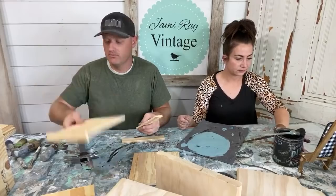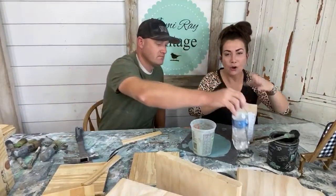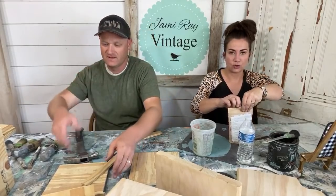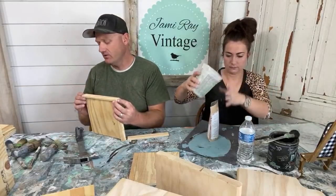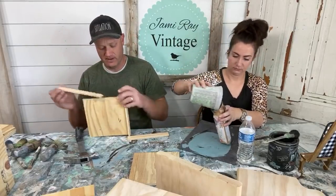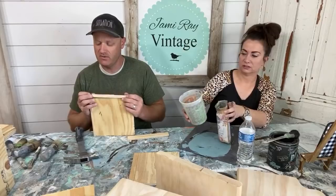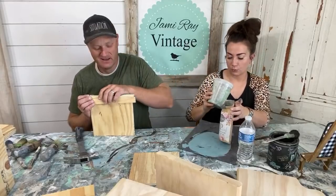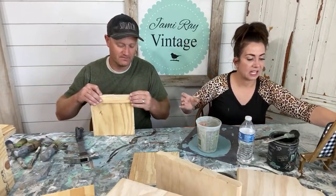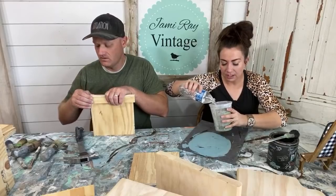I need the milk paint. So I'm using milk paint in zinc — it's going to make a really great stain. I just put a little milk paint in the bottom and add a lot of water when making a faux stain, because you want it very, very thin — maybe an eight-to-one or seven-to-one ratio. I poured way too much; you don't need much. I mixed this much stain from this much milk paint, which is more than enough to do all of these.